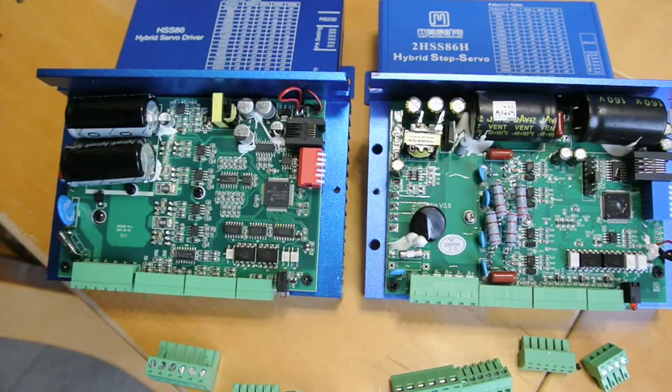On this one there is some circuitry that protects from short circuits, because this fuse here didn't blow when I had a short circuit. This one has a glass fuse and that had blown, so I was able to desolder it and solder on a new one without much difficulty, and that now restores this one to working condition.